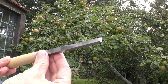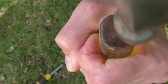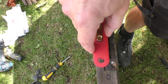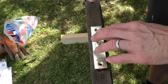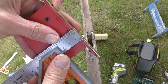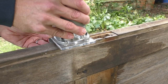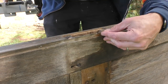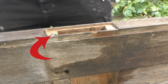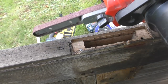You can actually get corner chisels and I'll be featuring one in an outdoor seating build very soon, but for today I'm just going to use a regular chisel since not many people will have a square corner chisel. After marking the area to be rebated for the deadlock faceplate - or outer forend - to a five-millimeter depth, I use my Ryobi quarter-inch shank trim router to do the rebating. Being careful to avoid an old screw I was unable to remove, I then tidied up the edges with my chisel and filed down the screw with my Black and Decker power file.